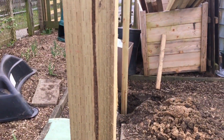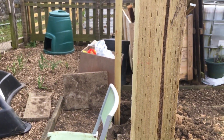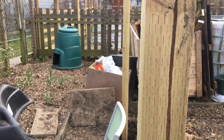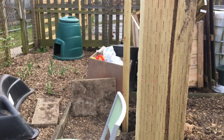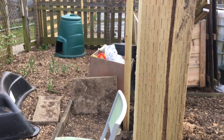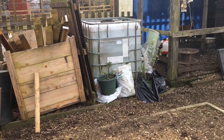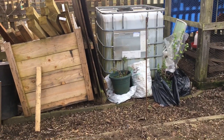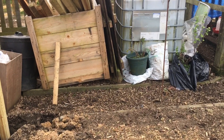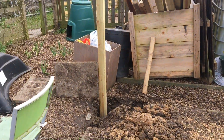I've basically put these posts in. Even if your posts aren't quite straight — flush together from here to there — it might be slightly off. I think mine was off by about 10 centimetres. I just compensated for that. That pole there is not quite 195 — it's just slightly less. As long as that is level with that, it doesn't really matter.